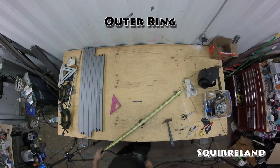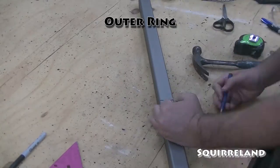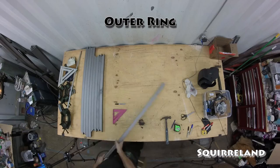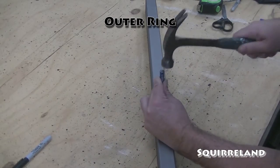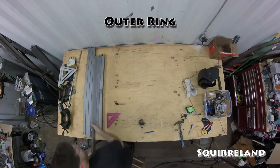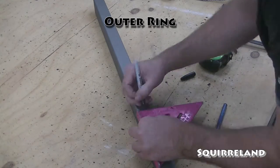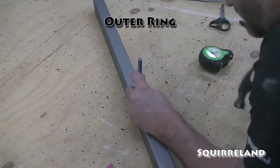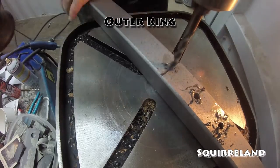Next I'm going to build the outer ring. This piece is going to be much more complex than the inner ring was, because the majority of the mechanism that makes the thing work is attached to the outside of this ring. Like the inner ring, I drill one hole in the middle of two of the tubes, and the other two tubes get three holes. Those three holes will match up with the flange-mounted pillow block bearings. One rotational axis needs to be fixed to the outer ring so that it gets rotated by the motor, and the set of three holes needs to transfer rotational power through the outer ring to turn the inner ring on an axis perpendicular to the rotation of the outer ring. If what I just said doesn't make any sense, the reveal at the end of the video might help clear things up a bit.